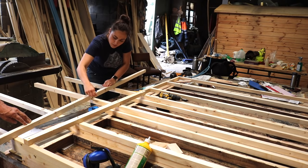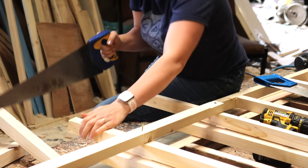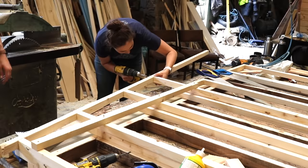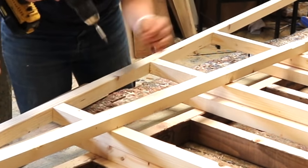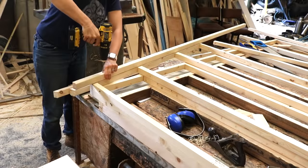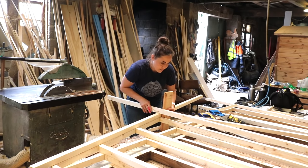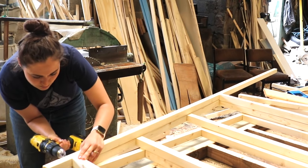I drew against it and cut with a handsaw, then screwed it on but with an overhang which was hand-sawed off later. With a sloping frame now, we were able to remove the temporary timber that kept the spars in place. Because it's got those upright spar measurement marks on it from earlier, this then becomes perfect to use as the last frame's bottom piece. Another top piece is temporarily screwed onto the first one as we need to match it. Then goes on the final uprights on top — currently longer — so we could mark from underneath where the top piece is, cut them down, and screw between the bottom and the top sloping piece.